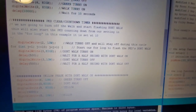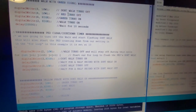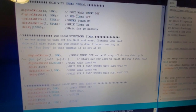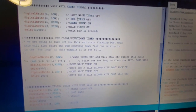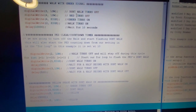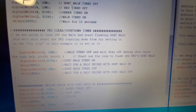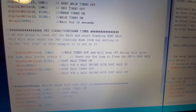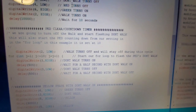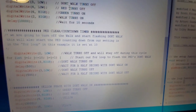How do we make the PED actually count down? The PED counts down based on how many flashes it receives. These were originally built as a direct replacement for the old pedestrian signals that just said walk and don't walk. When it got to ped clear — the part where it counts down — the old lights would just flash don't walk over and over for a set period. The countdown ones were designed as a direct drop-in replacement, so they count down based on how many times they cycle through the flashing of the hand.